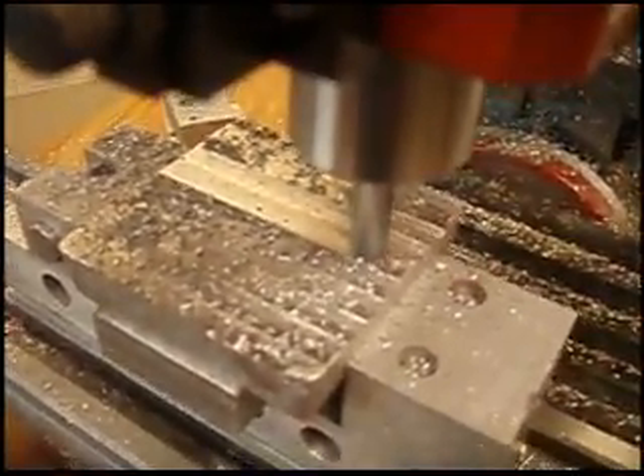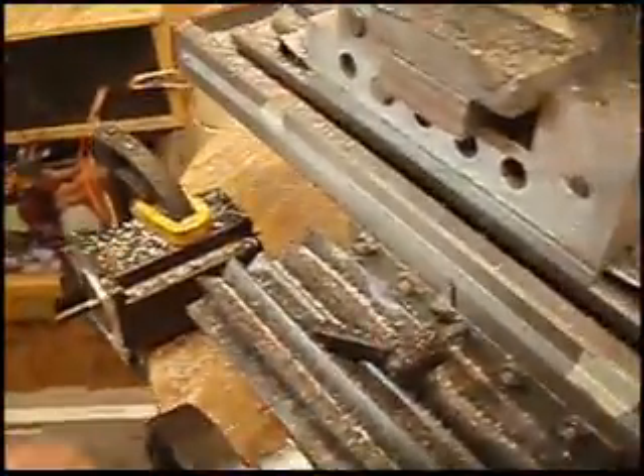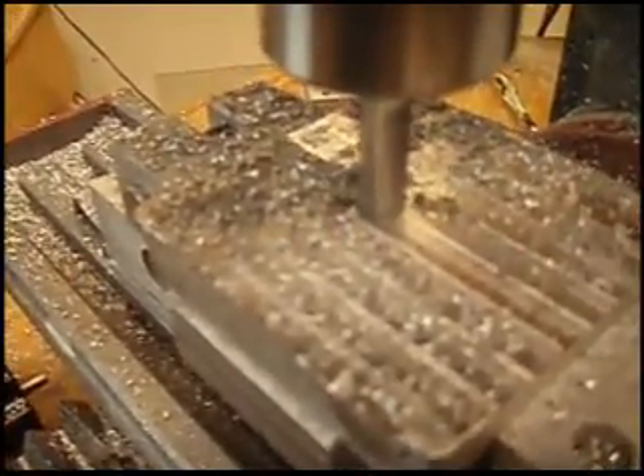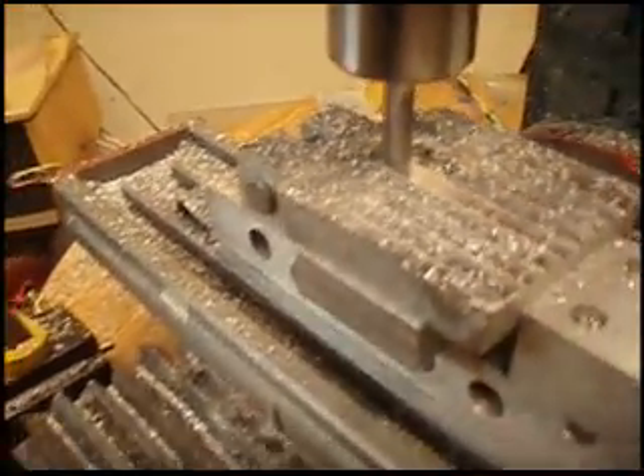as far as the feed goes, it's running pretty smooth. It's just the x-axis, and so the y — when it gets to the end, I just had it go a little past, to give me an extra couple seconds, and then I can go ahead and move it over. Three-eighths mil — I move it five-sixteenths — it gives me a sixteenth of an overlap. Seems to work pretty good like that.